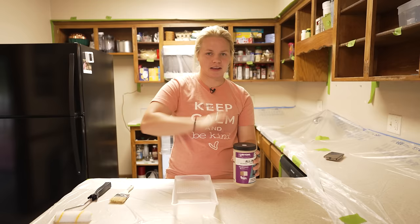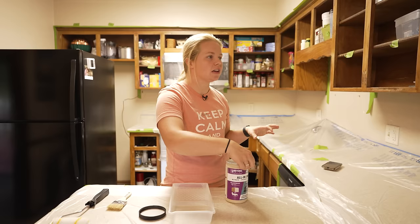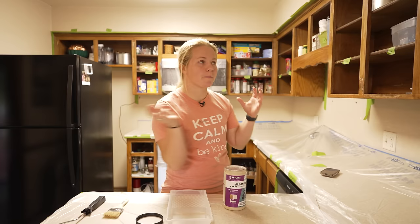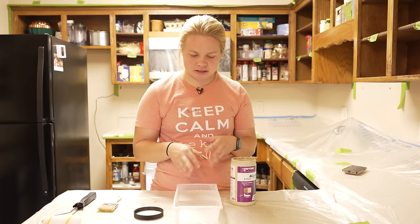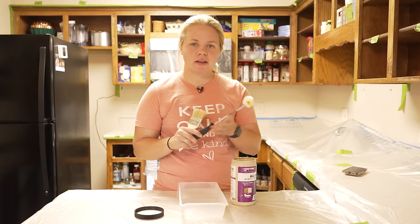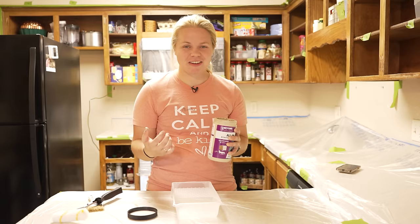This is going to need two coats, but we're going to start with coat one. The reason I decided to start on the kitchen first is because I want to get that on there and started drying, so that once I'm done with the bathroom I can come back and it'll be that two to four hours of dry time before I put the second coat on. I'm using a little paint tray roller, and I've also got my roller and my chip brush because this paint is better if you roll it on and then stipple in the areas that you can't reach with your roller. You don't need to stir this paint — it's all ready, and remember it looks funky when it comes out of the jar, kind of globbing out, but that's what it's supposed to look like.